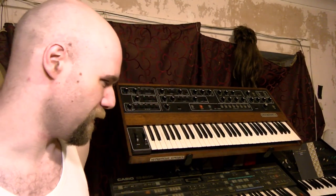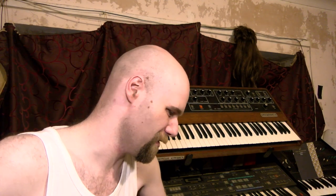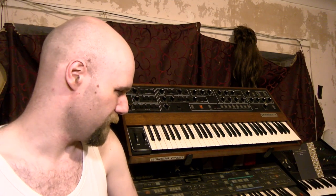And I don't recommend doing what I've done. It's relatively inexpensive, but it might get expensive if we blow the instrument up, so just get a cheap LCD. If you're willing to build your own power supply and stuff, I guess there's no real end to what you could apply this to. I mean, you could put one in a DX7. I think it uses the same standard, just has more columns on it. I think you can have up to, was it 40 or was it 80? I don't know, I'd have to look in the data sheet again. You can have bigger ones, you just drive it as multiple screens. So in theory, anything that talks that protocol, you could do this with. And it's pretty neat.